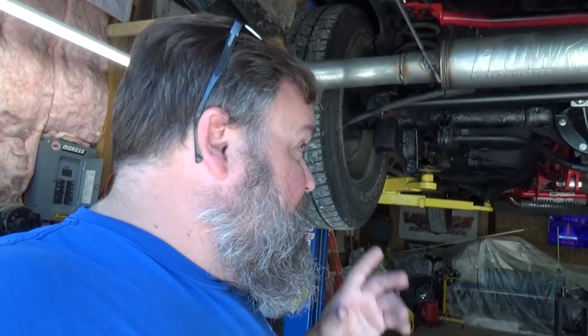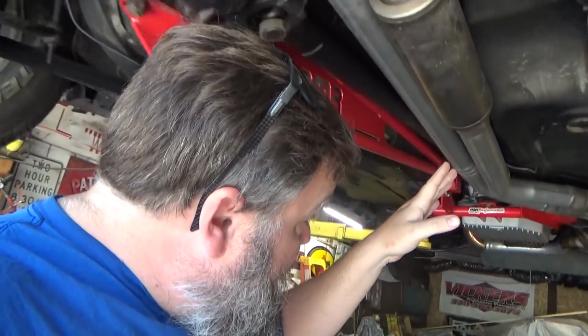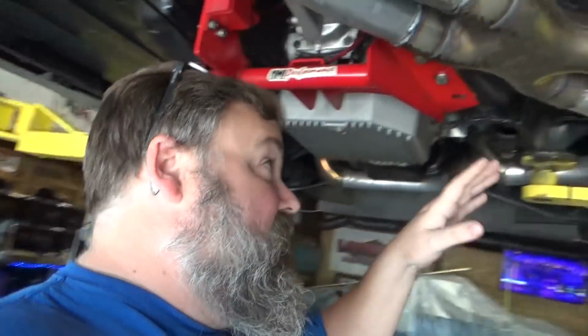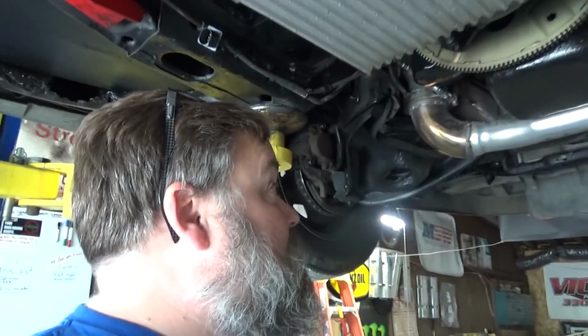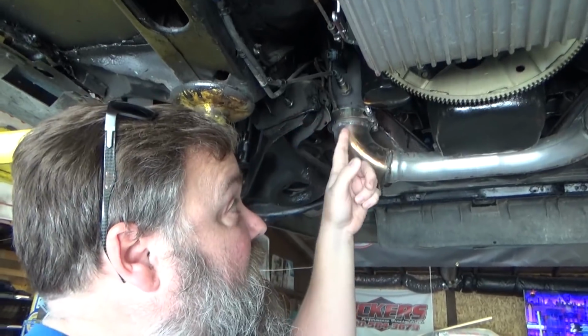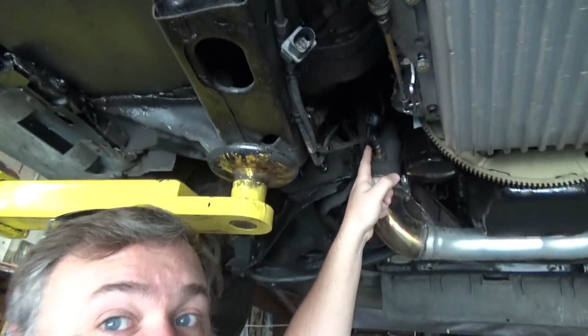So for those who don't know, Flowmaster FX mufflers, 2.5-inch exhaust all the way back. X-pipe, I'm not entirely sure where we got that from. That was a Rich order. And then 90-degree corners, and then Hooker mid-length headers. And it does have a tap for his O2 sensor. As you can see, Kenny's already got his O2 tapped in up there, so he can get some actual data out of this thing. So that's how this whole process goes.